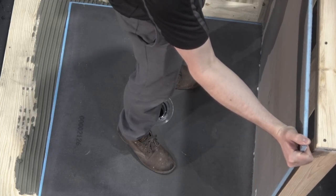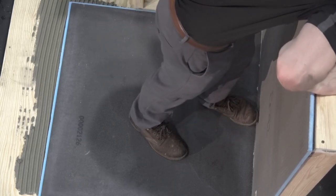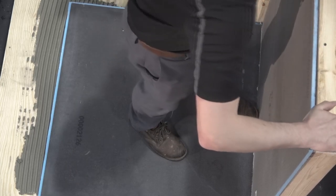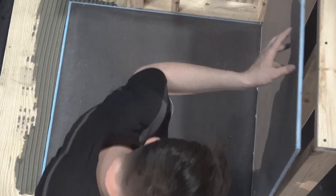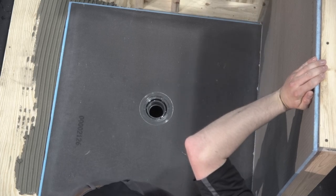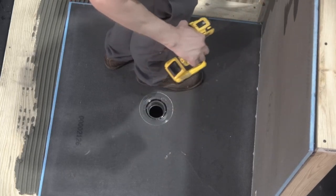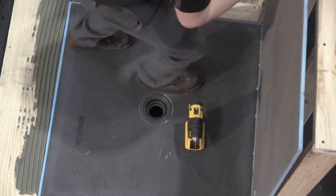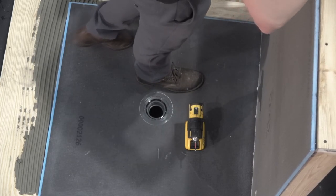Greg's going to compress the sealant and install a half-inch building panel. With Wedi, the blue foam is the waterproofing — that's an XPS, extruded polystyrene foam. So you're not relying only on a topical layer; we're internally waterproof 100% all the way through. Greg is going to anchor the panel at 12 inches from the top, then every 12 inches. No tricks, no glue to the studs.